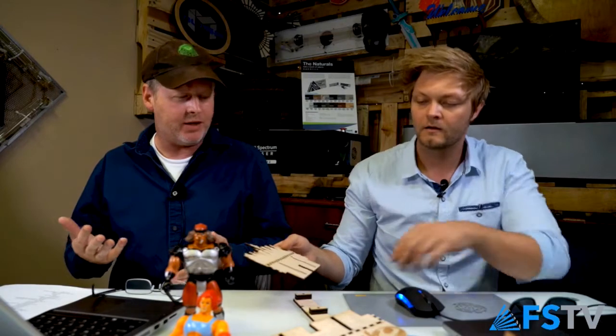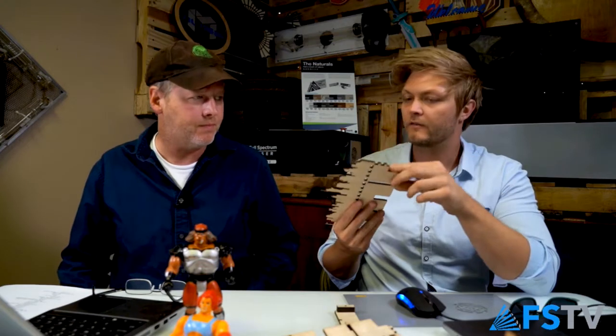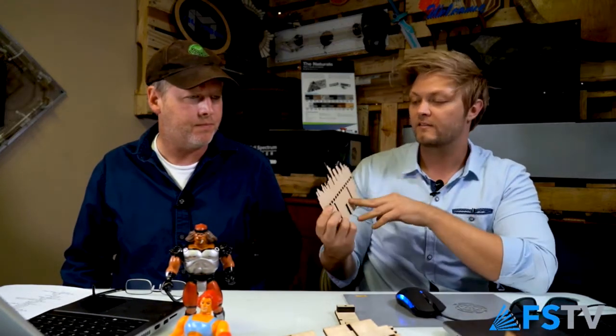So you're pulling this out. What could you do now to make it a little bit better coming right out of the machine, if you thought you got too much char on there? This one came out really nice. Like we always say, that edge, you want an amber color, and that is playing with your current. Dialing in your current is going to give you a better edge that doesn't rub soot off onto your fingers, and that's really ideal. But if we wanted to, we could stain this, paint it, clear coat it.